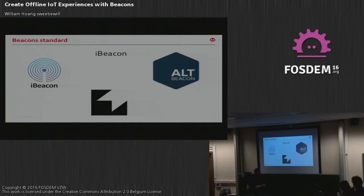It's broadcasting some stuff. It's localizing something, but it's outdoors. There is no limit of range with satellites. Wi-Fi has a broader limit of range. NFC has a very small range limit, probably 10 centimeters. RFID is probably about 100 centimeters, so it's quite small too. The best, from a size perspective, way of emitting something is Bluetooth, and it's low energy. It's much less consuming than Wi-Fi. So yes, they have a byte to configure the range of emission of a beacon.